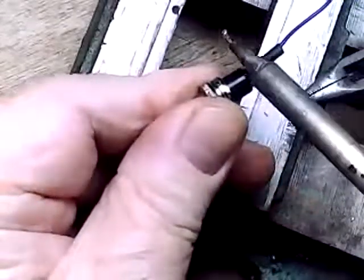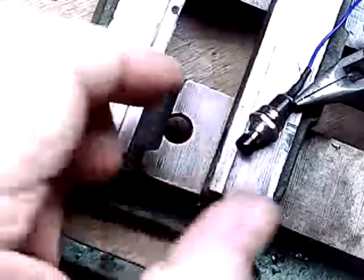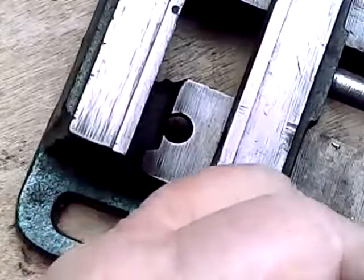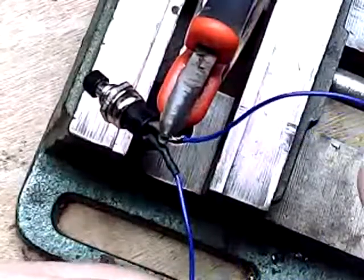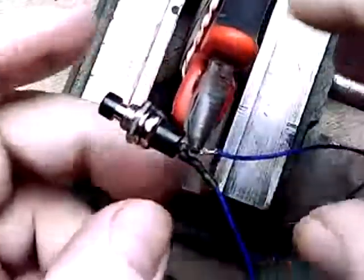And I ended up back here where it's nice and warm on the iron. And I say I got a heat gun, but no place to put it because the computer is right there, right where I'd set my metal plate for putting my heat gun on, because I have a wooden bench top. And there we go. Okay, time for the heat sink. Time to put everything together. Always check, make sure before you do that last solder joint on a wire that your heat shrink is on there, because you don't want to have to take it back apart and do the job over.